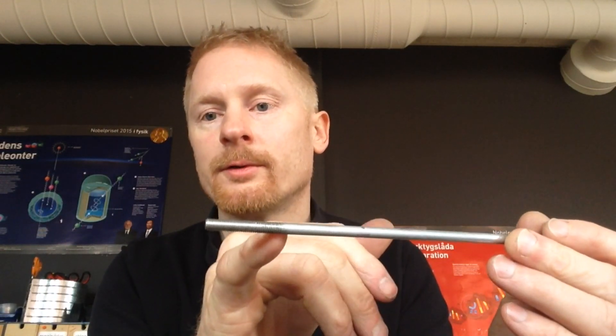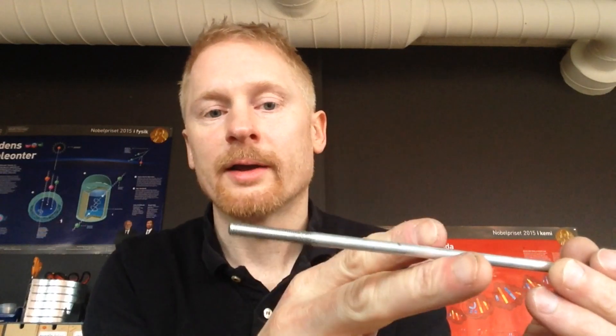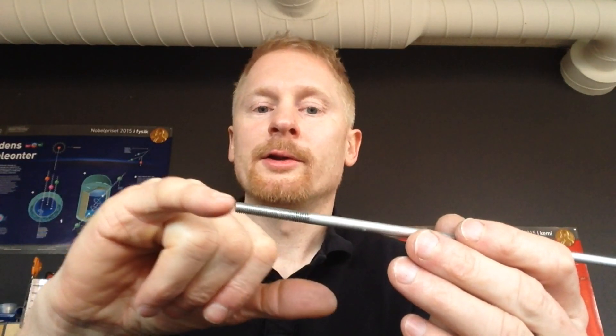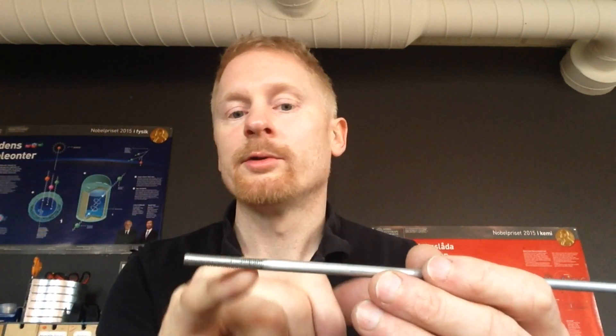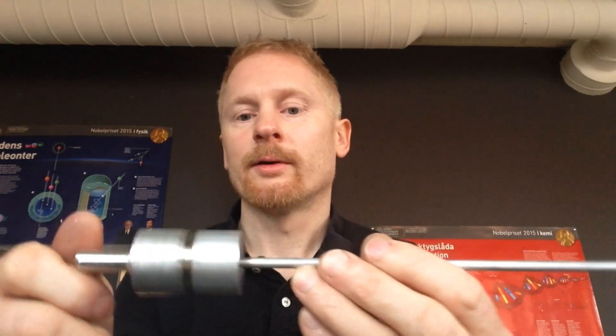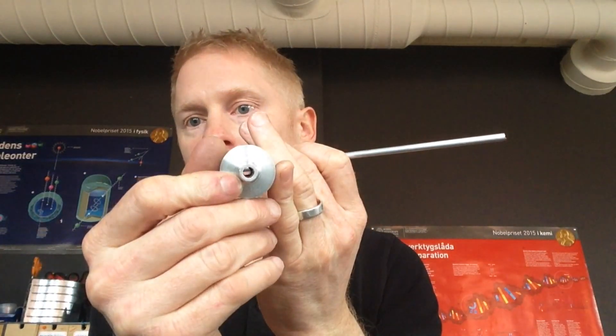Some tools are nice to have and other tools are must-have. One of the must-have tools is my threading tool. In this structure I have around 50 or so 5mm aluminum rods and I have to thread them at every end, so it's more than 100 threaded ends. If you were to thread them by hand with a die, you would not be able to do this build, because threading by hand you will always get a slight misalignment and the thread will degrade very quickly. So I made a threading tool which helps align the rod. The rod is put through here and it hits the threading die in a lined-up position, so you are able to repeatedly do threads that are accurate. You fasten this in an electric drill.